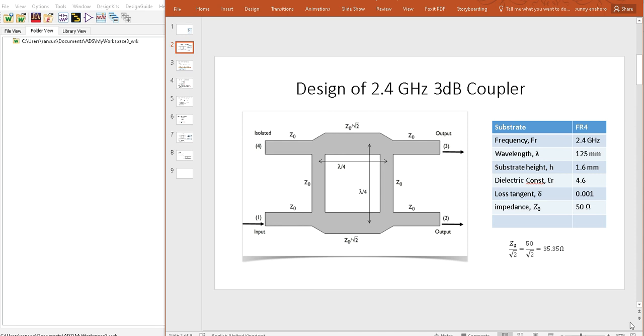Basically what this means is that in the coupler we have four ports: two input ports and two output ports. One of the input ports is technically isolated because it is only one input port that a signal is fed through, and there are two output ports from which the signal comes out. The two output ports are 90 degrees out of phase — that is, 90 degrees separated from each other — because the signal has to travel a longer length to one of the ports.